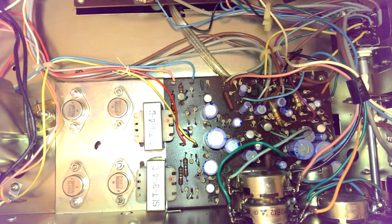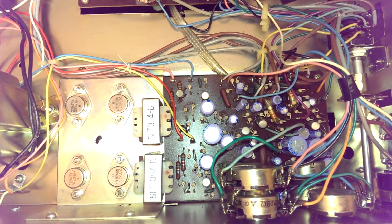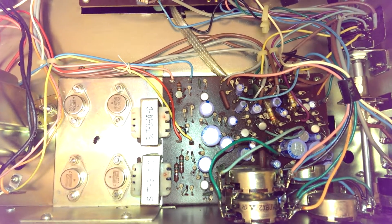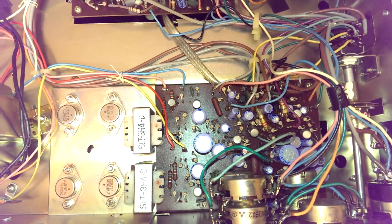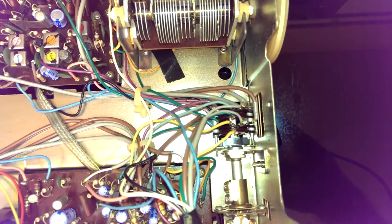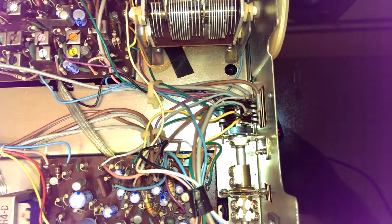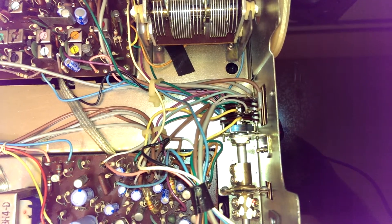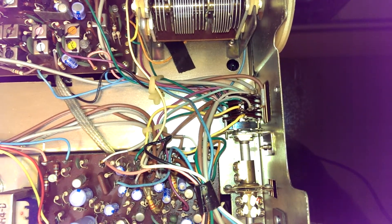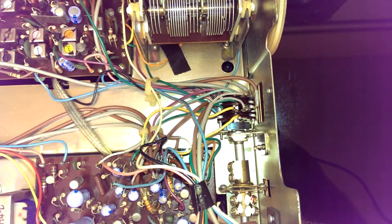It does seem to be quite a bit more advanced than other germanium amplifiers that have graced the bench. It's certainly a better and fancier circuit than what you'd find in a Magnavox Astrosonic — it's not as powerful but I think it's better, and it certainly does sound better. A lot less weird sounds; this one sounds much more neutral. Progress was made between 1964 and when this was made. I'm not real sure when it was made — probably somewhere between 1968 and 1972. Anything later than '72 and it would be all silicon most likely, and anything earlier we'd see bigger transistors and parts. There's a bit too much miniaturization for it to be much older than '68.